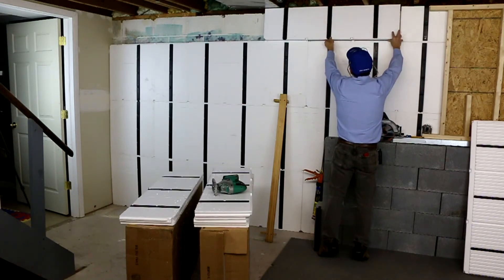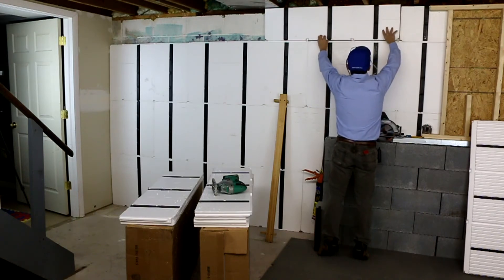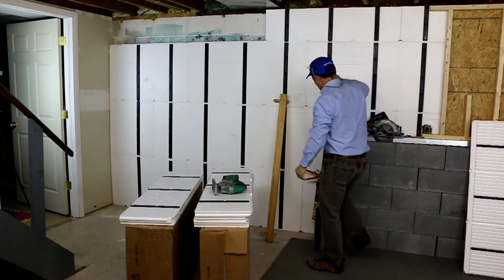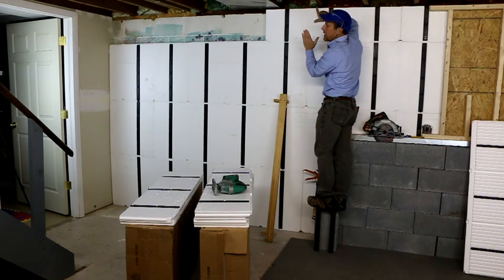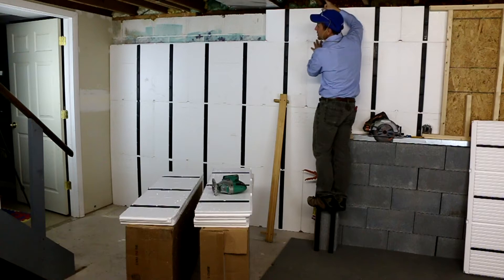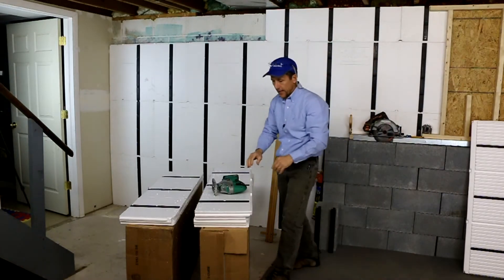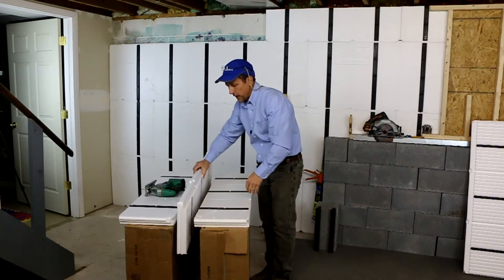You can see it's short, and we measured it to this interlock. So this interlock now, we can pull it on down tight. It's up and down. Otherwise, what you would have to do is, if it was a full panel and you were trying to make this fit, you would have to notch out right by this wood joist to make sure that you could lift it up and drop it down — the interlock, the tongue and groove, up and then back down. Here's the piece — the top part of the panel that we cut.